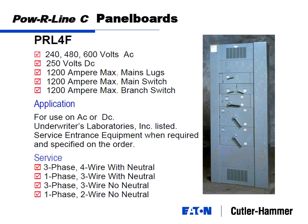In the worst case scenario on space is fusible. And I would say I know we're a circuit breaker company. We don't make fuses, but we make fusible switches to put in here. But the number one detriment I would say on fusible switches is the space. This is probably a 60 amp switch, a couple of 30 amp switches, and a 100 amp switch, and then maybe two 200 amp switches. And that almost fills up an entire panel board. I could take that much in a circuit breaker panel and probably put it in about this one space. Big difference in space requirements.